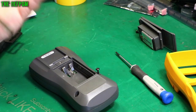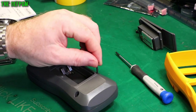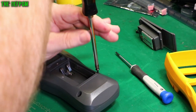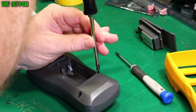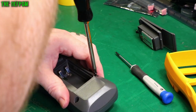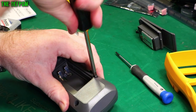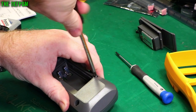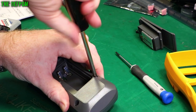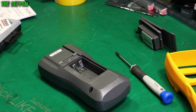A tip I should always mention: whenever you're reinserting a plastic screw, don't just drive it straight in. First go backwards until it drops into the existing thread — you'll hear it click. Then drive it in. That way you're not cutting new thread each time, so you don't end up destroying the plastic. Each time you cut thread, it chews out plastic, so always reuse the same thread.